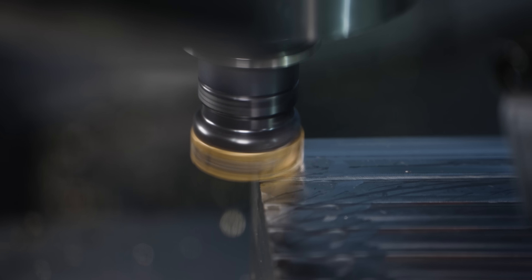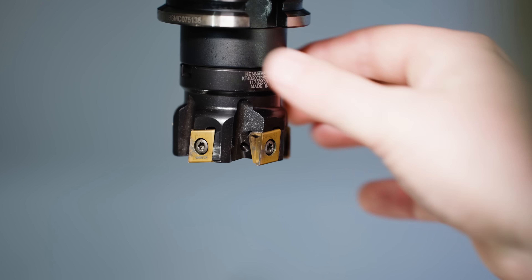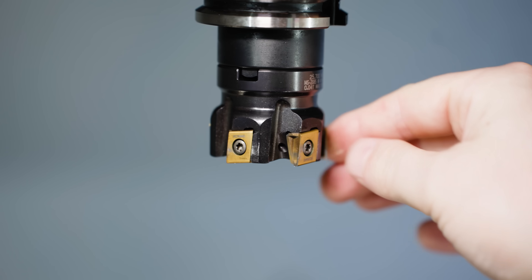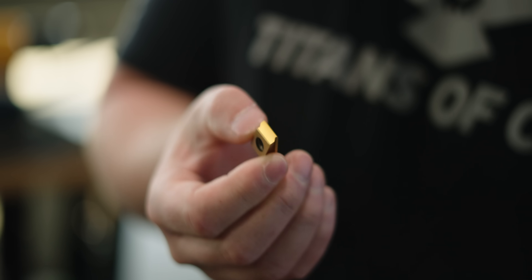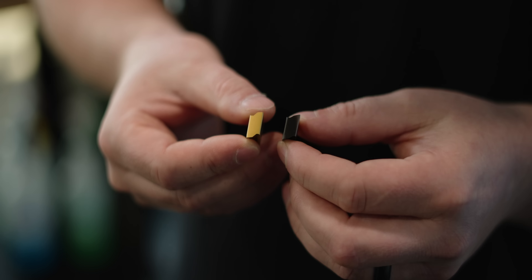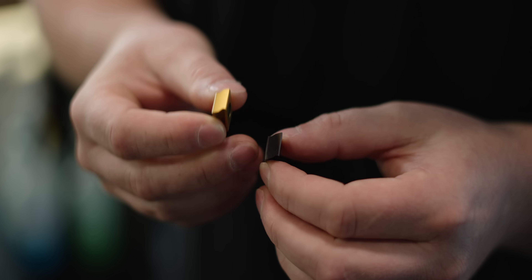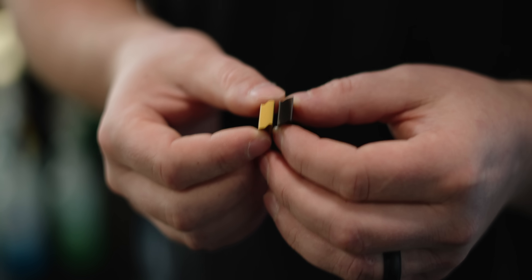We just took an eighth inch off the top of this material and got rid of that mill scale. The inserts still look good. So now we're going to come in and do some heavy milling — we're going to come around this part taking 200 thousandths deep axial cut and just do some contouring around that. One thing I haven't mentioned yet that's helping us out today is that I'm using the new HD geometry insert, which is specifically for roughing and your more challenging applications.